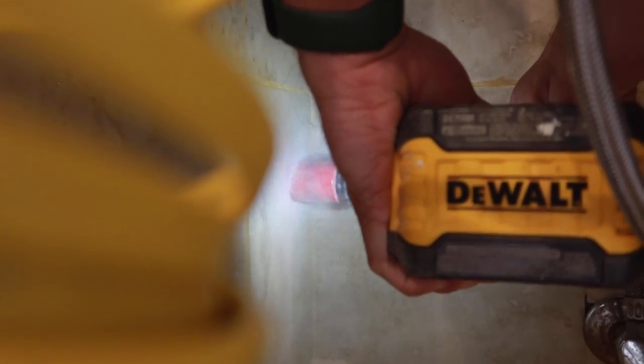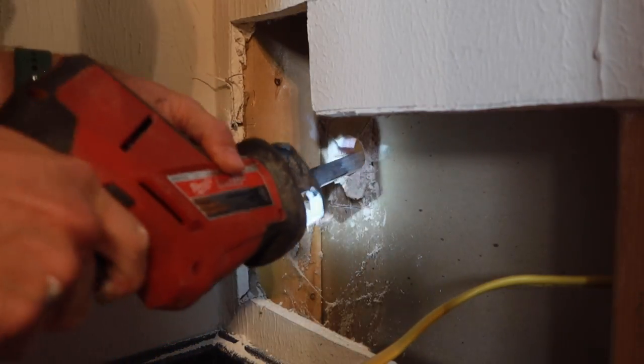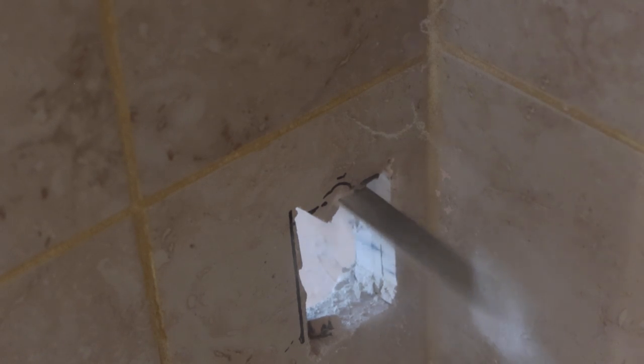The problem is I don't have a lot of space to work around the toilet, so I'm actually going to be working from the back side, hoping for the best so I don't chip out the tile too badly. I have a diamond blade on my little reciprocating saw, so I'm just going to take my time, mark out where I want the receptacle box to be, cut around that line as carefully as I possibly can, and hope that it doesn't chip out too bad.